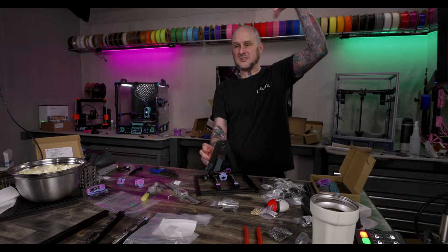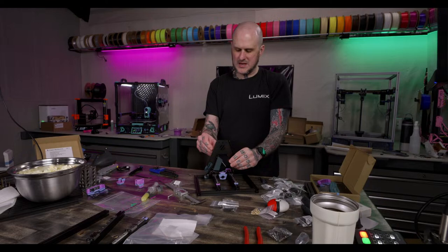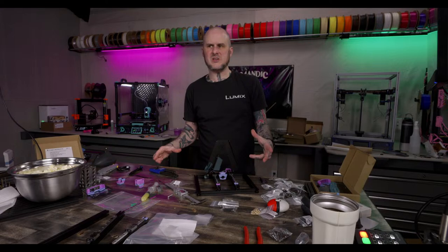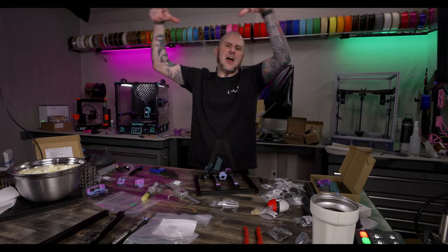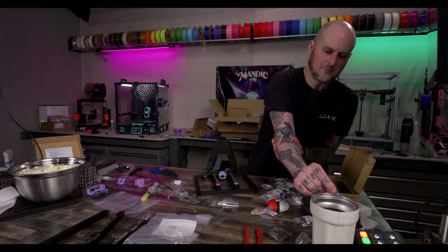Since it's a 2.4, there's really nowhere to put the heater other than in the very top of the chamber, but I don't want the heater to be right next to the CPAP hose or something like that. So I want to build it taller than a 300 build would be to give me some headroom at the top to put the heater and other stuff in there, and then probably still build a hat on top of that, and also to not limit my Z-axis build height. But if anybody knows where I can get 350 LDO Doom Cube extrusions, let me know.